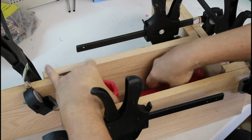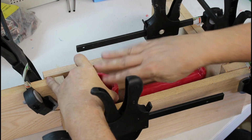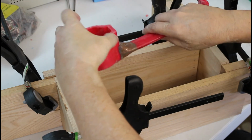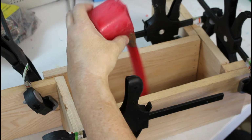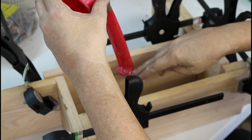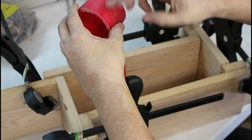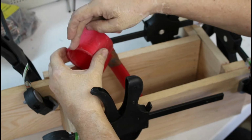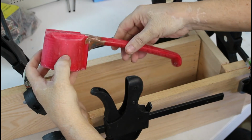Of course, we got more depth than we need, so it'll be built up and set like that in that L-shaped configuration with a bottom part that supports and then comes up to pour that. We'll pour from the top. We'll turn it up on its end when we're done, and we'll do the pour through here so that way we don't get any air trap down here in the handle section. And we'll fill it slowly until it fills all this, comes up, and we'll probably put a little air relief up here. So the pour will be here, air relief over here, and that's how we'll get it done.